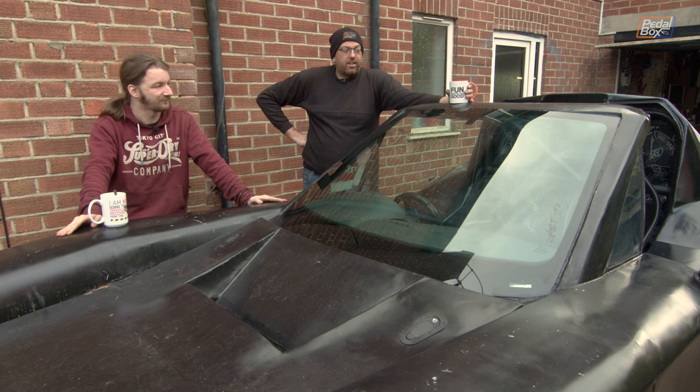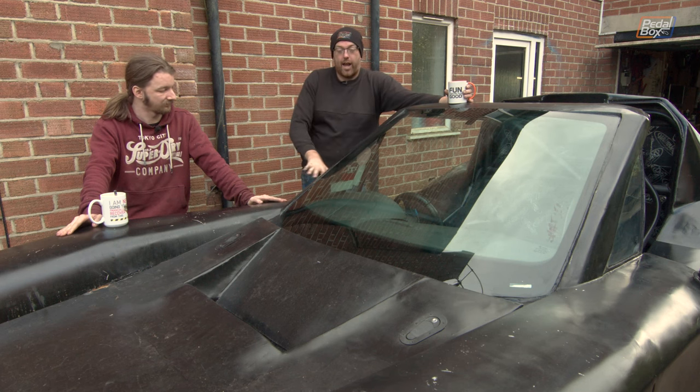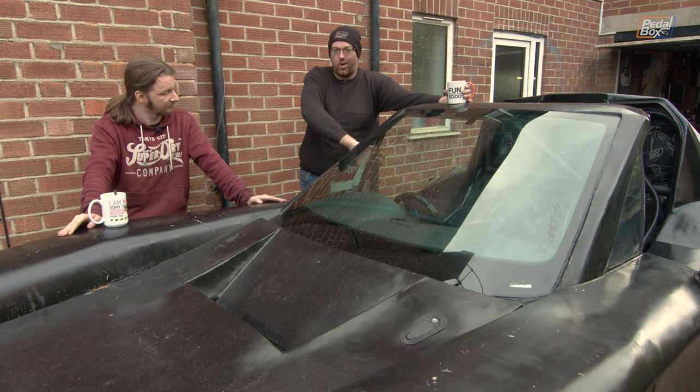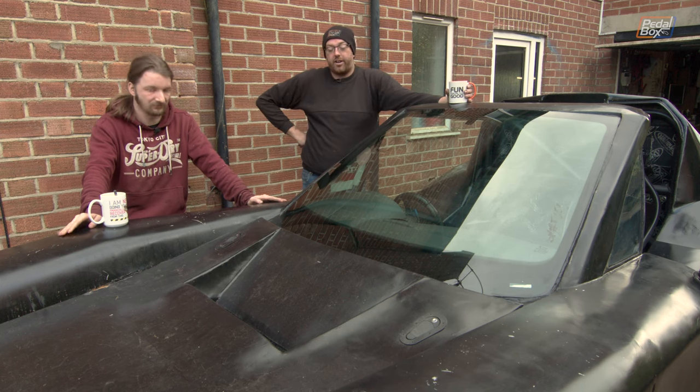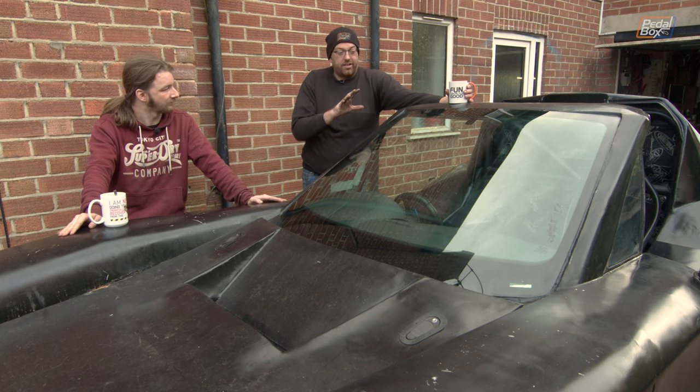Yeah, I could not be happier, and it looks so good. And the quarter lights went in really nicely as well. There's the usual little gaps around them where they don't quite fit because they've got a bit of curve, and we might not have put quite enough curve in these frames. And again, they've been added to and moved around thermally a little bit when we've been welding. So the fact that they all fit at all and we can fix it with a little bit extra silicone is just thrilling. Yeah. But they're in, they seal nicely.